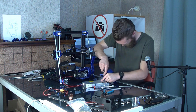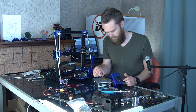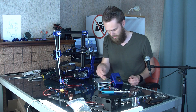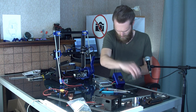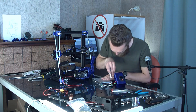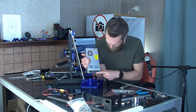You can add this to the end side and remove this cap. Normally you would use these four holes to connect something at the end, but I didn't want to tap these holes and I reckon not everyone has taps lying around. So I had to invent a T-slot nut with the side approach — it's more like a plug so you can screw it in and it will expand and stay in place. My next tip regarding safety: it's recommended to put a tie wrap around the three wires of your power input, because if one of these wires snaps loose, the tie wrap will prevent it from springing loose and touching something.